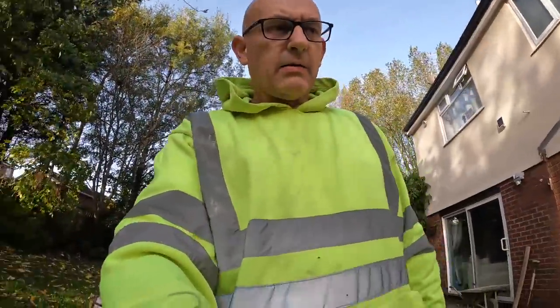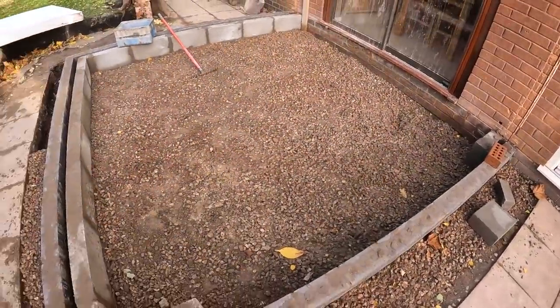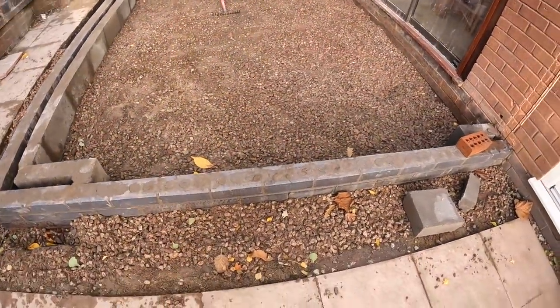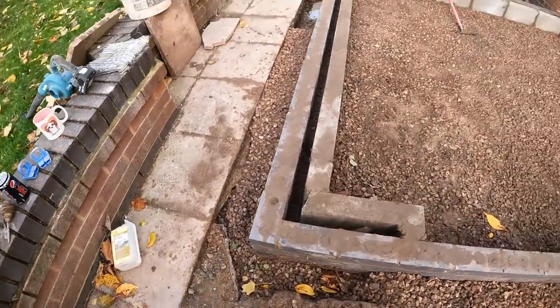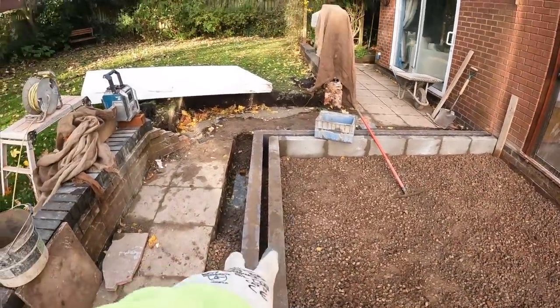Okay, since I think we'll make this a step-by-step video how-to, we'll show you where we're up to so far. So, our brickwork's up to DPC. We've thrown a bit of stone around the outside just for us working. Kept it down on the corner to get our profiles in, and then Alex is going to get the rest of this done later. But yeah, it's a 250 cavity wall.